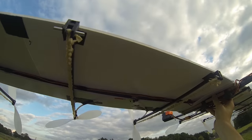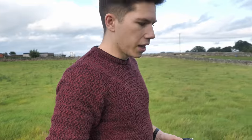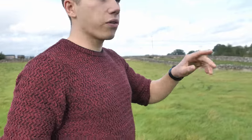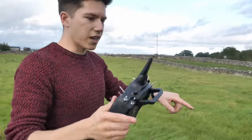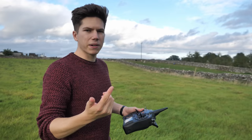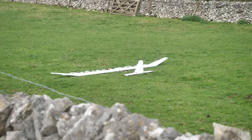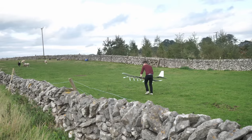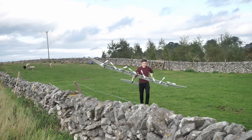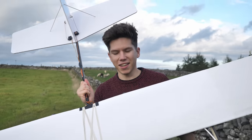I think we had enough power for about 50 metres. I was going to try and climb a bit but it didn't really have the power available. With all of the propellers moving the same way, I didn't have quite enough authority to make it go left — there was a bit of a torque roll issue. That was just over a 16-second flight in total, four seconds clear of my target, which was great. In a way it's a shame I wasn't able to get it to fly free-flight, because a lighter aeroplane would have flown further.